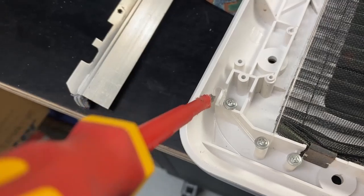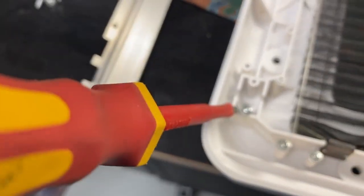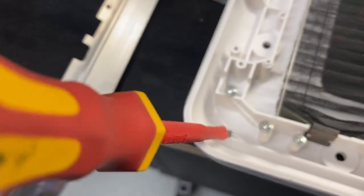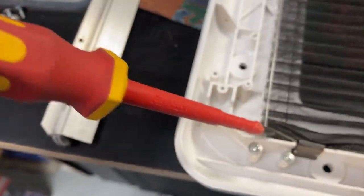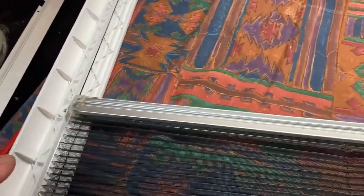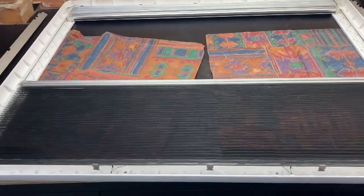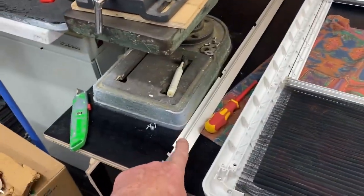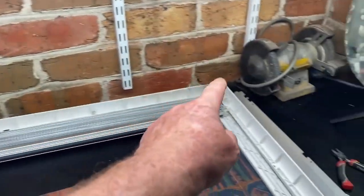Then we feed it through this little channel and put the excess down the bottom here. Don't cut it off at this screw — leave yourself a little bit of a tag, maybe 50 to 60 millimetres of tag, so that if you need to re-tension this cable you're in a better position to do that because it will give you something to hang on to. With that done, now we can turn the screen back around and refit our side trims back onto these rails. We'll do a bit of a clean up while we're here.